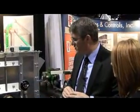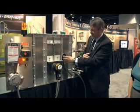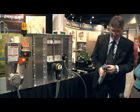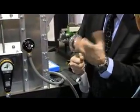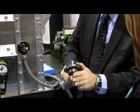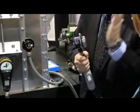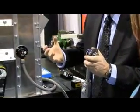One other very important hazard monitoring sensor we need to look at is belt misalignment. This device here — the touch switch device — is mounted on the side of the elevator or conveyor. As the belt comes over and touches this hardened stainless steel, it activates the sensor. As the belt comes over, it's not heat generated, it's force activated, and that will give you an alarm and a shutdown.